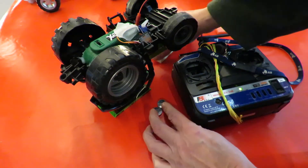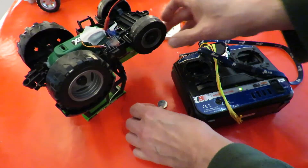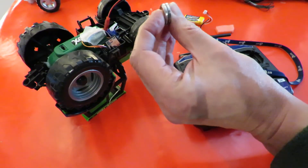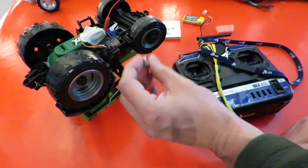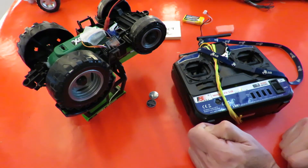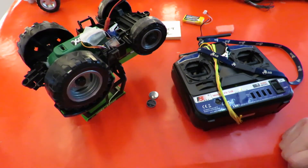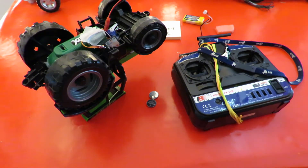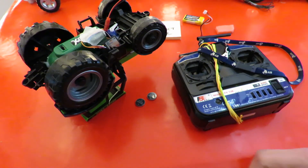So that's the answer to the question, Fenris. Yes, you've got the voltage from two 2032 cells, but they don't give you enough current to actually do anything with it. So yes, technically you've got the voltage. Practically, no — you haven't got the current draw.